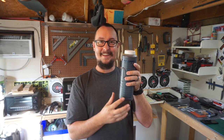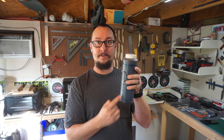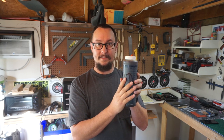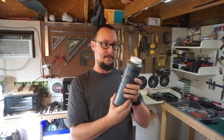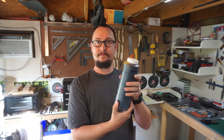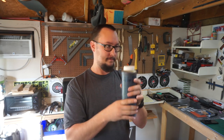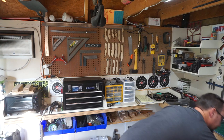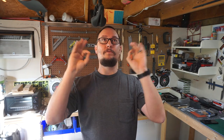I've had it in different size containers as I've made larger knives — each time I make a bigger knife I need a bigger container. The current one is a marine fuel/oil mixing bottle for marine equipment, from Walmart. The 50/50 ferric chloride and distilled water mixture works great. When I first started I was using straight ferric chloride, but I found the diluted mixture on some forums and it's worked perfectly ever since.